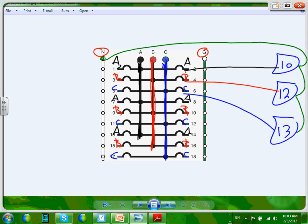And what you're looking at right now is called a multi-wire branch circuit. Any question, you have to understand as a designer how they connect them. This is a typical multi-wire branch circuit, coming from every phase. So circuits 2, 4, and 6 are a multi-wire branch circuit. You can bring them to a receptacle, or you can bring them to a light, or you can bring them to an air handling unit. As a matter of fact, any load that needs a three-phase and a neutral.